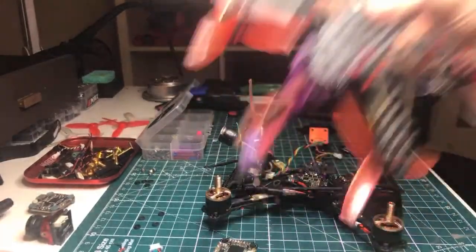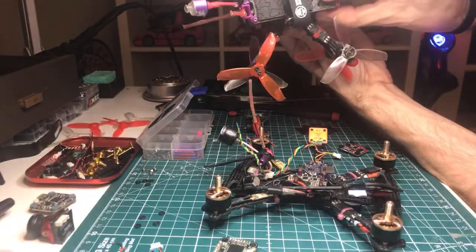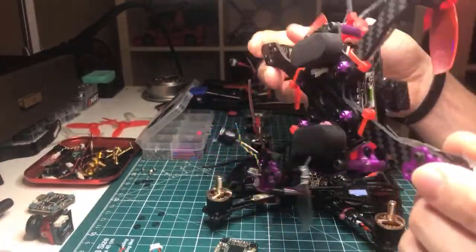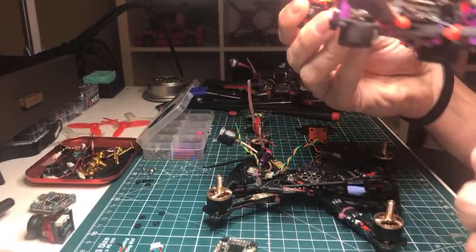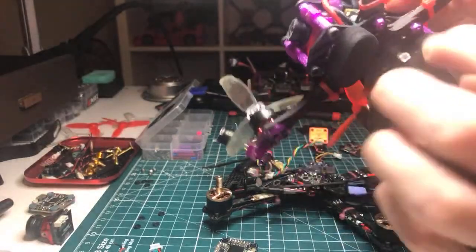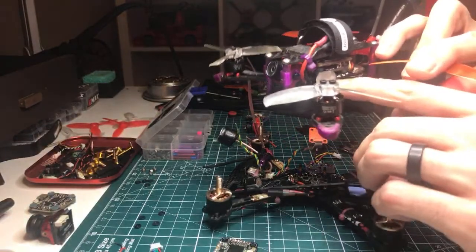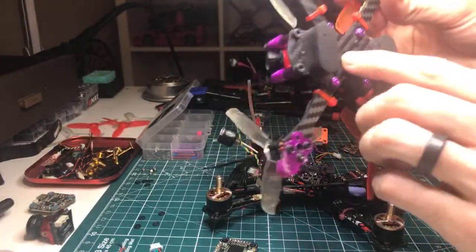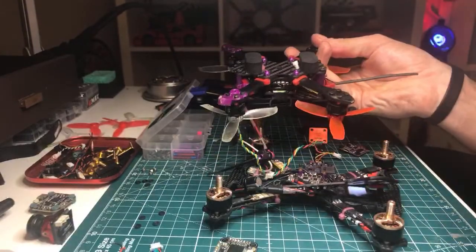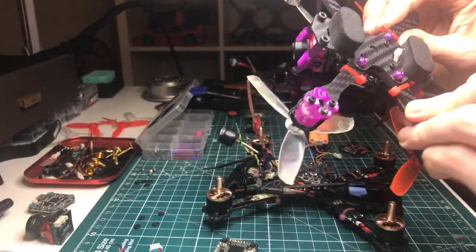So interestingly, the weight of this unibody, same exact geometry, same everything, is pretty much exactly the same as the weight of the removable arm version. The offset is, we go to a thinner center section, because like we talked about, it doesn't need the thickness or the strength. You do gain a sandwich plate, but that's fairly small. And you do gain hardware. And those things offset the weight difference of having that 3mm carbon on the inside. And then from that point, it's just all pluses of everything we were just talking about.